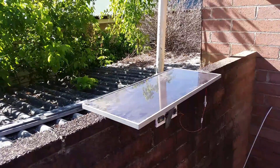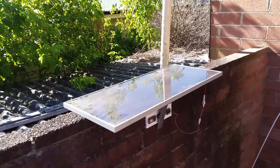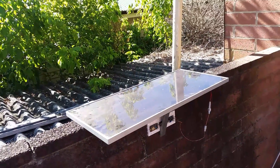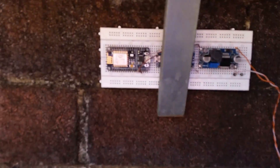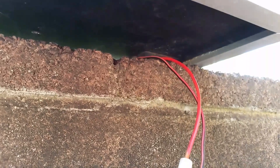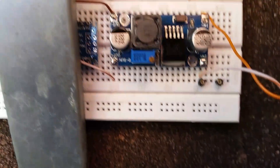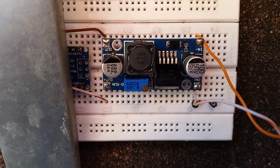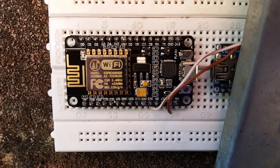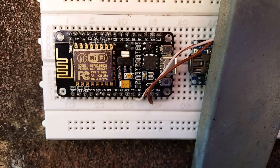This is a demo video of running an ESP8266 via a solar panel and via a buck converter. There's the solar panel just with afternoon sun where we are at the moment — it's about five o'clock. The solar panel leads run directly into the buck converter, which is an LM2596. I got this one for a dollar from Hong Kong with free postage, and it's regulating to 3.3 volts to directly feed the 3.3V input on the ESP8266. Proof of concept seems to work quite well.